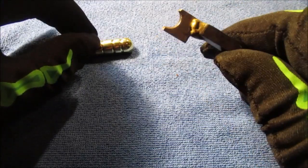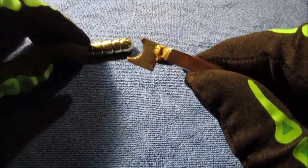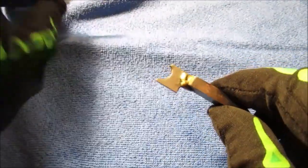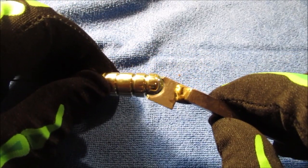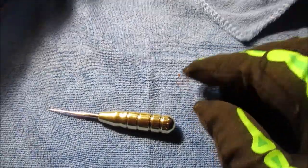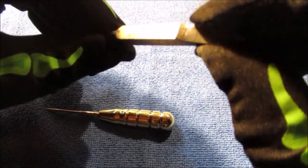This I'd made years back. This is a cutoff blade. I know this is crudely made, but it was a bigger one and I broke it. But there's a bevel on here. See where that bevel's down? So if you look at this side, you have to kind of come in at an angle. This thing's so pokey. So imagine a bigger one. You've got to come in at an angle like this and work your way around. It takes a little work, and you can only really do it on brass or aluminum. I mean, you're not going to take that little homemade tool and really bear down with 1/4 inch.